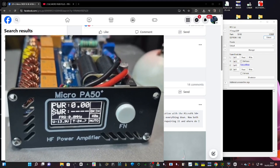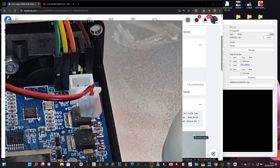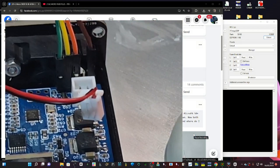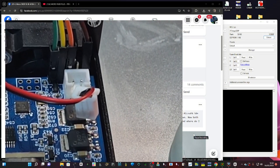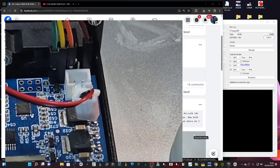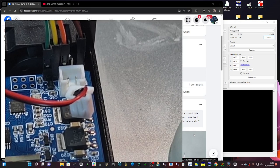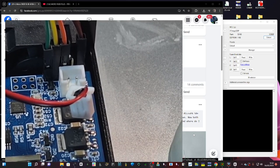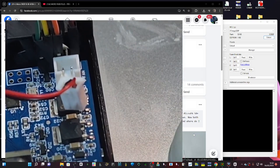Of course you need to connect your cables in the right place. Let me show you on the device. There are two screws and the top just lifts off. At the back I've taken off that connector — it just pulls off. You've got one two three four five pins, and the colors I've used are green, yellow, orange, then at the end brown. I left one pin unused.